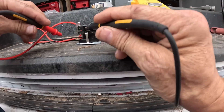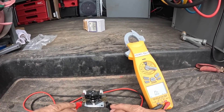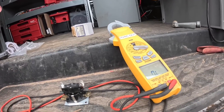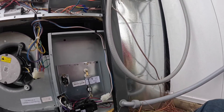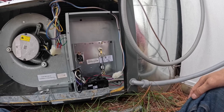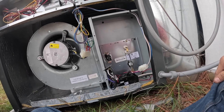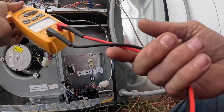28 ohms — I think we found the issue with the heater kit. If y'all remember one of my past videos, they had the wrong heater kit and I had to remove all these molex connectors and basically redo the molex plug so it would work.